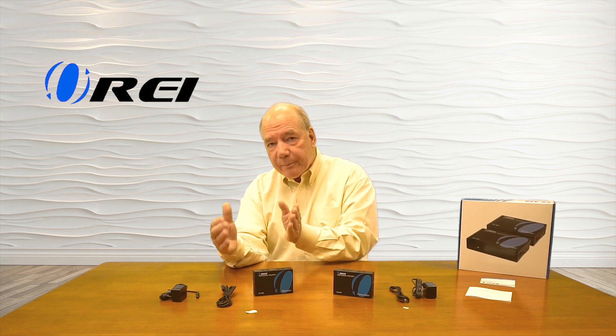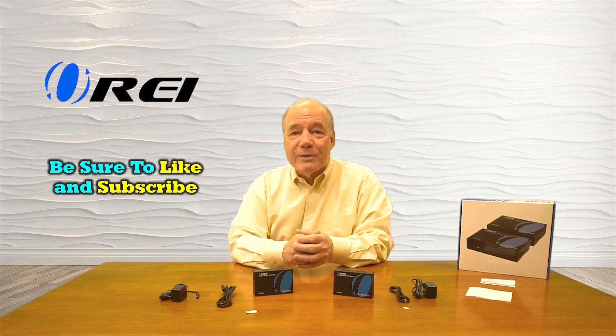I hope you found this overview of the EX330 HDMI Extender Kit helpful. It provides a very simple way of sharing any HDMI media content with a second location up to 100 meters away in full 1080p resolution over a single Cat5e or Cat6 cable. The infrared blaster kits make it easy to control content from the remote location by picking up infrared signals and sending them back over the same LAN connection to the primary location. You can also expand up to 253 remote locations by simply plugging more receivers into your switching network. Everything you need is included with the kit, and with a few simple connections you'll be up and running in no time. Thanks for watching.